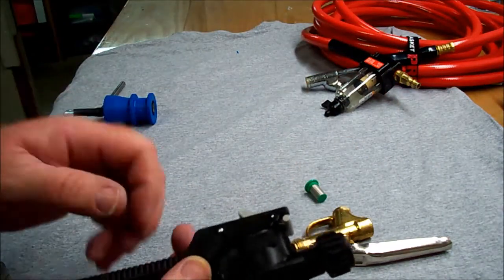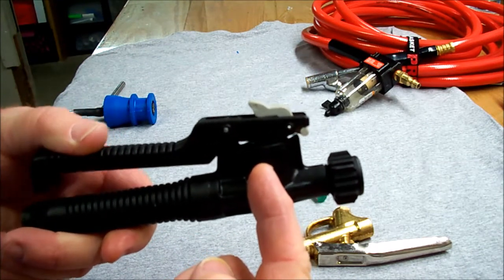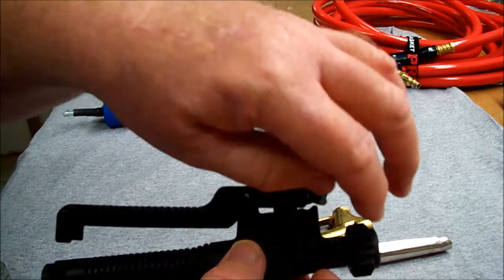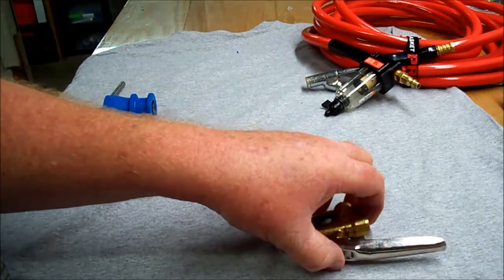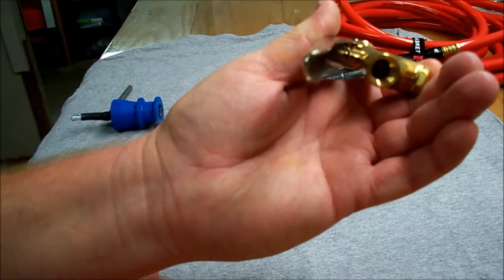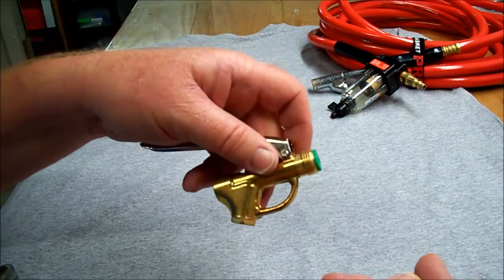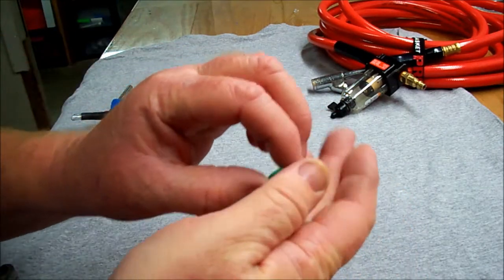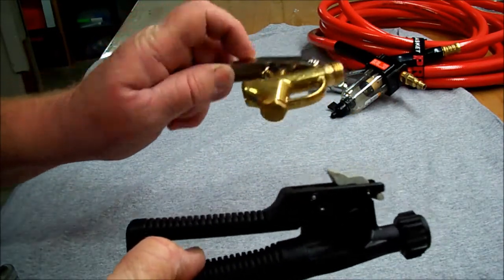On your tank, the only moving parts, period, on your tank, this right here, this mechanism in here, as this moves, it's going to wear, and as it wears, the last point on this thing, if your filter's back here and you don't have a strainer, then any contaminant that may come off, where the plastic is shearing or rubbing off by moving of this, or inside this, any wear that's going to come off of this and the mechanism that's inside of it, which is rubber rubbing against brass, it's going to wear. Well, if you don't have this in the end to catch it before it goes out, then you've missed one whole step of filtration. So therefore, the 100 mesh is great for catching the particles that may wear off of either of these two pieces.